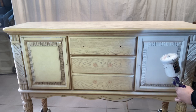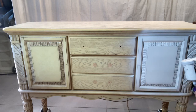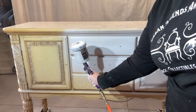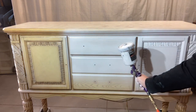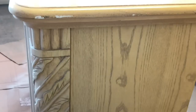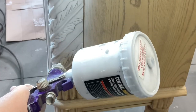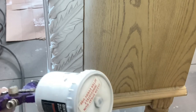Since this buffet has a lot of nice carved details — which I love — I'm going very slow with my spray gun, back and forth, to make sure that I get even coverage in all of those yummy little nooks and crannies. I'm being very careful to spray the bottom side of this lip so no part is missed. Here's a close-up of the carved wood as it gets sprayed with my HVLP Pneumatic Sprayer — it's working really well.